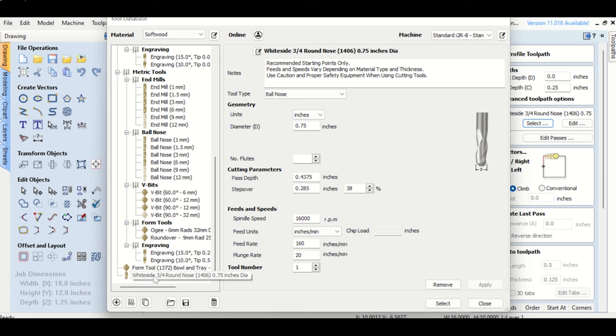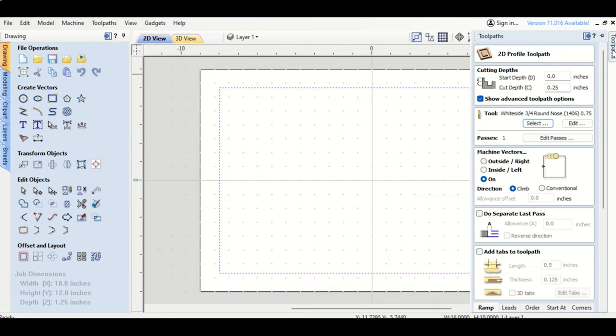I just click on the bit and use their recommendations. I want to cut on the line. Depth is about a quarter inch — that's how deep I go on my juice grooves. A deeper juice groove is great for function, but a quarter inch is sufficient. One pass at full depth is a lot of material especially in hardwoods — it's pretty aggressive — so I like to slow it down and do four passes.